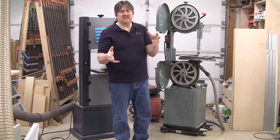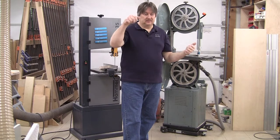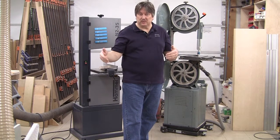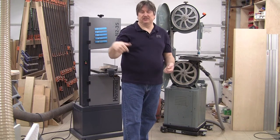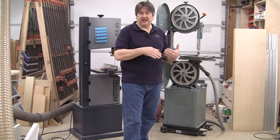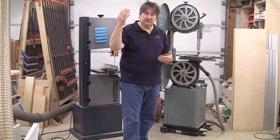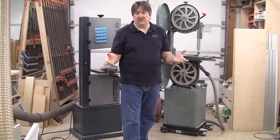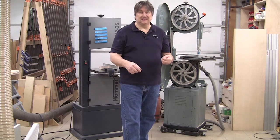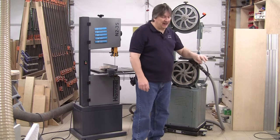So they took that basic technology of a two-man saw going up and down and applied it to some mechanisms and attached a water wheel to it. And now that two-man saw was being operated in an up and down fashion, powered by water, and all they had to do was create a carriage or a passage for the log to move through the moving blade. What they found out was the same thing that you've found out if you've ever used a jigsaw or a saber saw, is that that blade only cuts 50% of the time, because as it pulls down, it makes the cut.